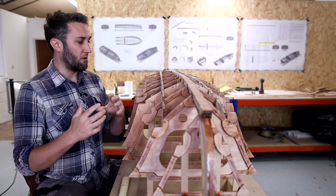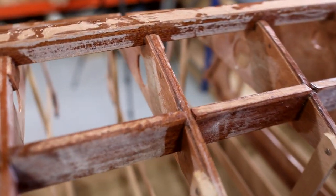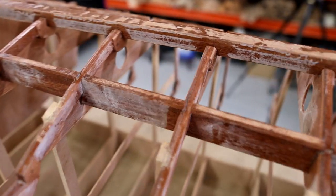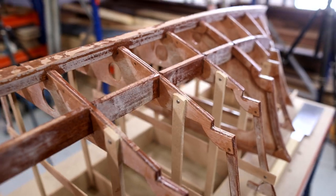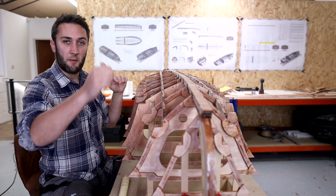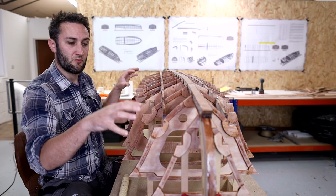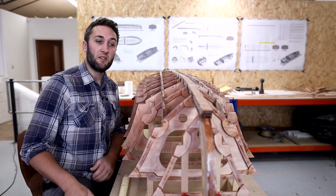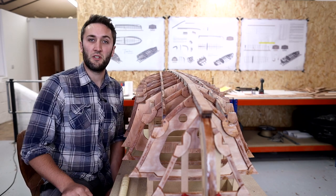There are a number of different things going on with this boat. We've got the stringers that need to be beveled - those are notched around the frames. It's the other way around with the keel, so the frames are notched for the keel, which means that's going to be approached in a slightly different way to the stringers. We also want to get our chine set in place - we laminated that in one of the earlier videos - so we'll look at doing the notches to receive our chine, and we've got the stem to do as well. We'll do the stringers first.